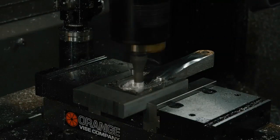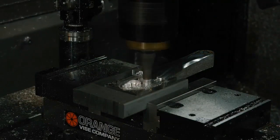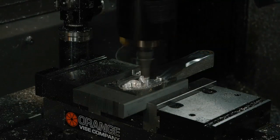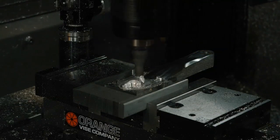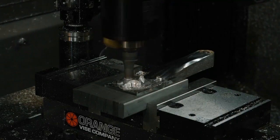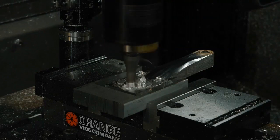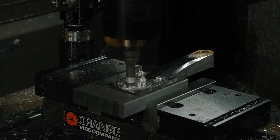Now this is showing the friction stir welding system — it's a bit dark and I apologize for that — but we are friction stir welding a shaft up through this spider and crank arm assembly. We're welding the 7075 aluminum to titanium 6-4, which, just like 7075, is considered not weldable, especially with these two bi-metal welds. We've just gone around that shaft area.